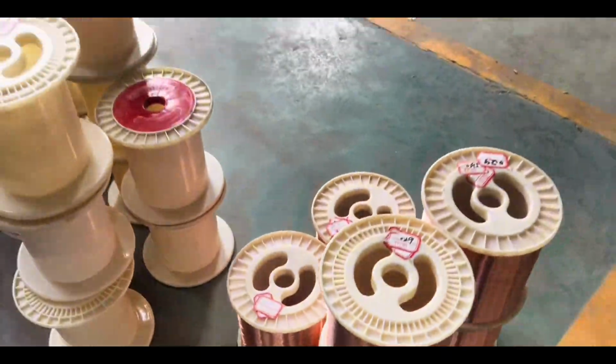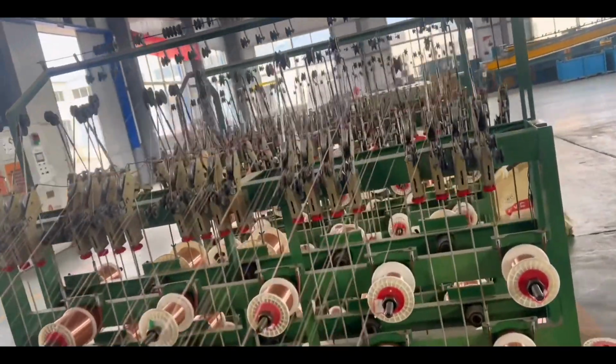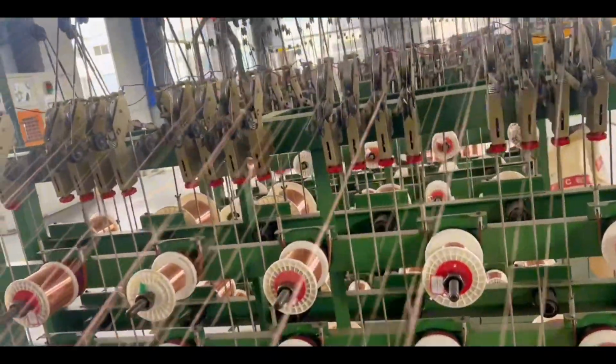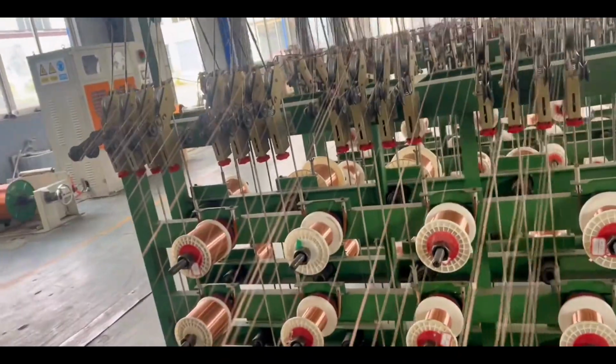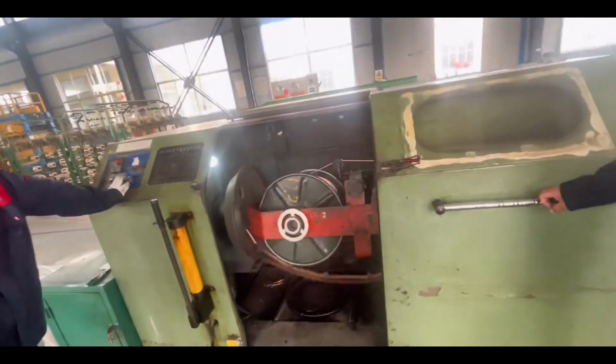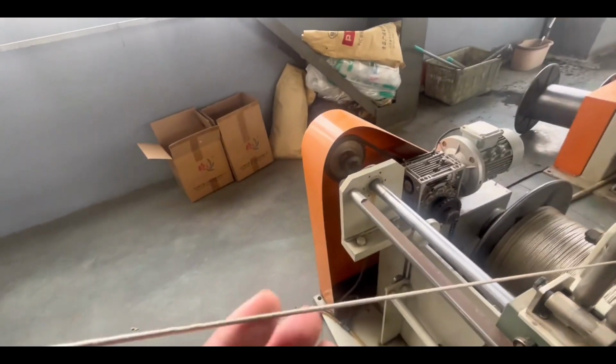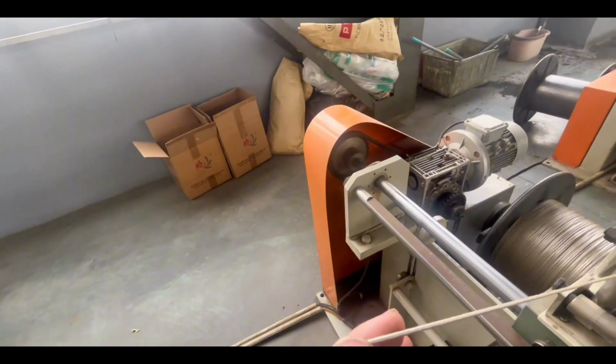After pulling the wires, you need to merge these hair-thin wires. Normally, when you see wires, there are many hair-thin strands inside, which means there are many wire strands. Continuously spinning, after this machine completed the initial wire merge, there are still some special wires that need to be wound with 2 layers of mica tape. During high temperature periods, the insulation can still be maintained.